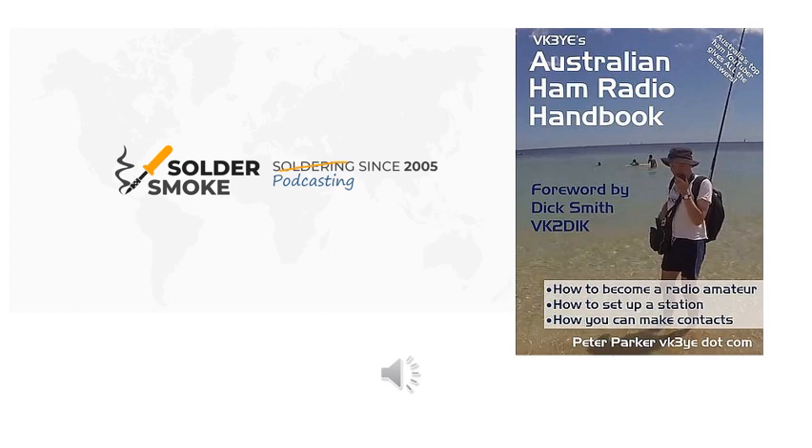Getting back to SSB — the Codan rigs that were Australian-produced are still made, but more sophisticated now. Then there were rigs like the Atlas 210 and the Atlas 110 twins, which I owned. If you look at the circuit of those, it has a lot of similarities with the BitX — very sparse in the use of components. The Atlas designers permitted themselves more ICs than Farhan did, but basic concepts and very high dynamic range. Then in the 80s, there were the SL600 series ICs — British designs used them — but they were only available for a short time. Then we had the NE602 in the late 80s, which was great for a simple receiver, SSB generator, or double sideband.